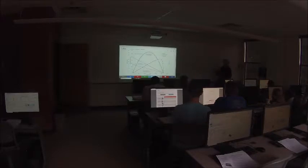So the motor allows current to flow through as fast as it can, right? And then as the motor starts to turn slowly, it generates a little bit of back EMF, and that resists current going through the motor, okay? And that means that not quite as much current can go through the motor, which means that not as much torque can be produced, okay? But the motor continues to accelerate, like we talked about. It continues to accelerate, and as it accelerates, it generates a stronger and stronger back EMF until it gets to a point where the back EMF is equal to the voltage that you're applying to drive the motor. And at that point, no current is flowing through the motor, and it's not producing any torque.